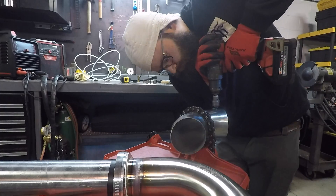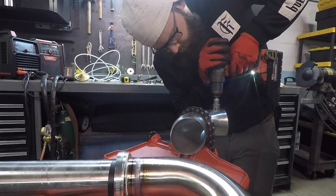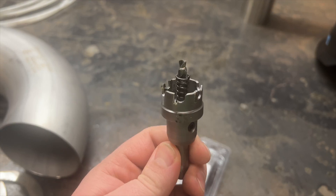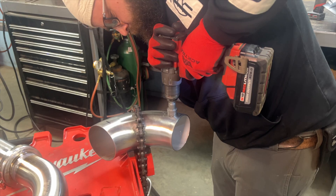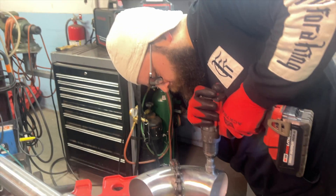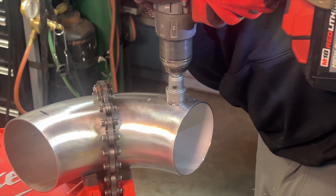Cory's going to blow some holes in the four-inch outer jacket. The hot water will enter through one threaded port, fill up the jacket, and exit through the other. We're using carbide hole saws from Easy Arc — they're spring-loaded for slug removal, about 20 bucks a pop, and we can get quite a few holes out of one bit. I'll link them below as well.